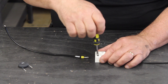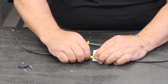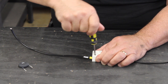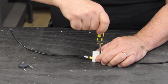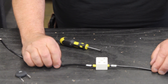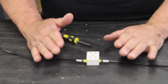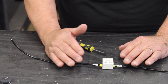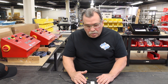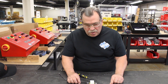We're going to loosen that screw a bit more and put that wire in there. We've now jumped out that line, and we have primary heat going to the hose transformer, but we've removed the bad inrush current limiter. This is not a safety hazard — nothing's going to overheat or over-temp. If you continue to have bad voltage coming into your machine, you're more than likely going to trip the breaker for the hose heat circuit up in the console. But this is how you jump out the inrush current limiter.